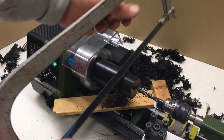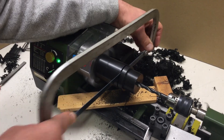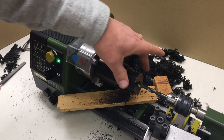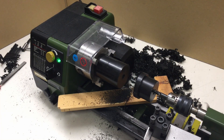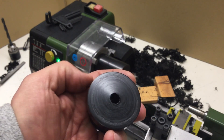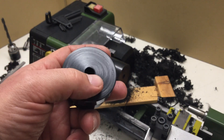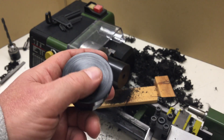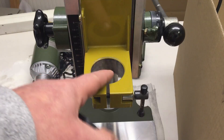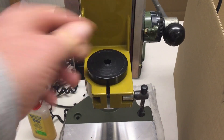As soon as it gets too hot for the thumb to press down, you have to stop. The end is near. The surface finish of that method is not totally terrible — you could probably leave it, except that it's a slightly cone shape. The hole here is a little bit oval, through the heat or other forces. We will clean up that side, but before that let's check if our plug actually fits in here. Tight fit — perfect.